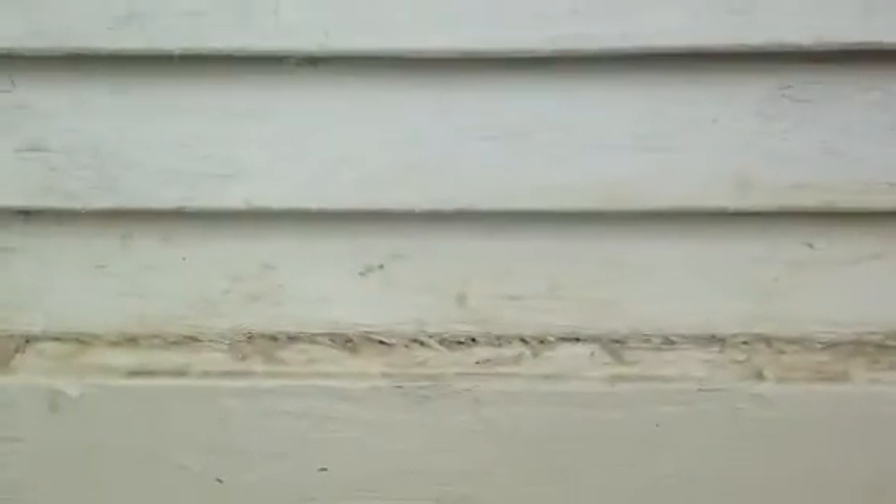Jump down here to the screen door — I primed this area here. Those louvers or whatever they're called are not primed, but down here it is. So you can see the difference between the primer and the area that was not primed. This is one coat of primer on the really rough areas of this door. The next step in this process — right now today — we are going to start our second coat of primer. This will get sprayed; that's why it's taped off here. We're going to completely spray it and back brush it.